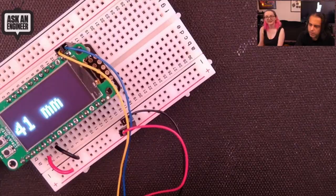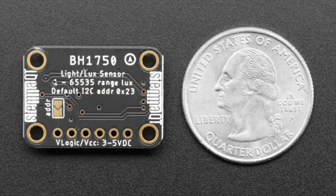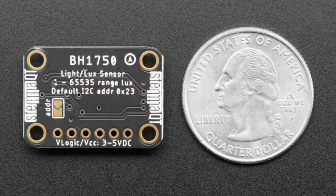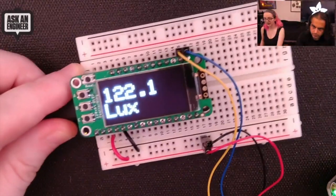Next up is the BH1750. This is an interesting sensor because it's actually a very old sensor. The reason we decided to carry it is that we have a search system called Algolia, and I noticed that every week people were searching for this part number. It turns out there are a lot of projects using it — just like the MPU-6050, there are sensors that have been around for a long time that people use, but don't have a good breakout with level shifting and STEMMA QT connectors. The BH1750 is a pretty simple lux sensor with a really wide range — up to 65,000 or even 100,000 lux depending on the gain, down to one lux.